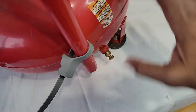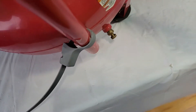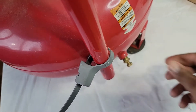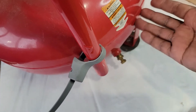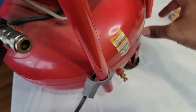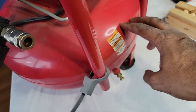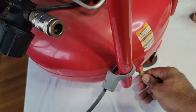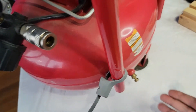Once all the air is out, you have to tilt the tank like so. Over a period of time, moisture gets in here and it'll rust. They don't make these in stainless steel. They kind of want it to rust because if it didn't rust, this would pretty well last your lifetime — as long as you oil it and change the filter. But anyways, that's a little tip there.